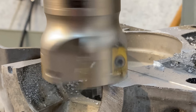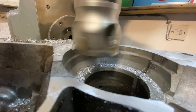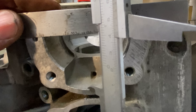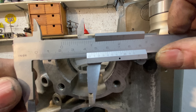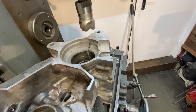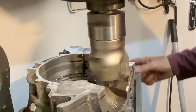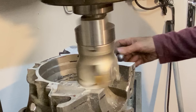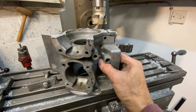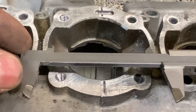The cast aluminium material machines really nicely. I take a steel bar resting on the surface that I've just machined and measure down to the side of the transfer port, getting a dimension which needs to be half the width of the original crankcase dimension — and it is absolutely spot on, so I'm really pleased with that. I start milling the surface and keep going until I go down to the line that I've scratched with my scriber. With the machining complete on the left hand crankcase part I offer it up to the right hand crankcase part and it fits perfect, and I double check the dimension and it's exactly right.